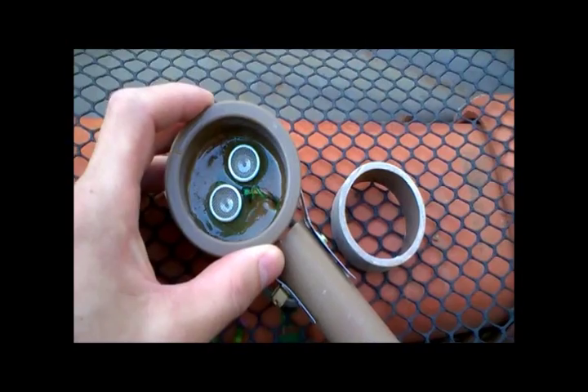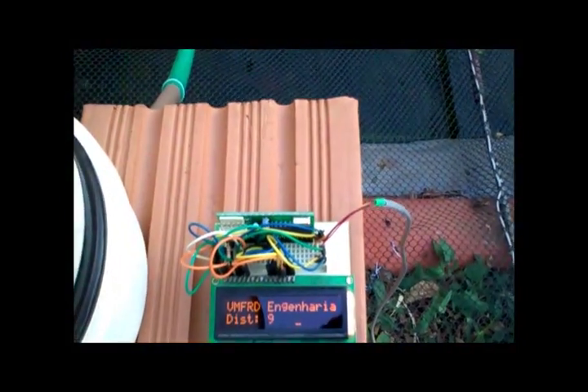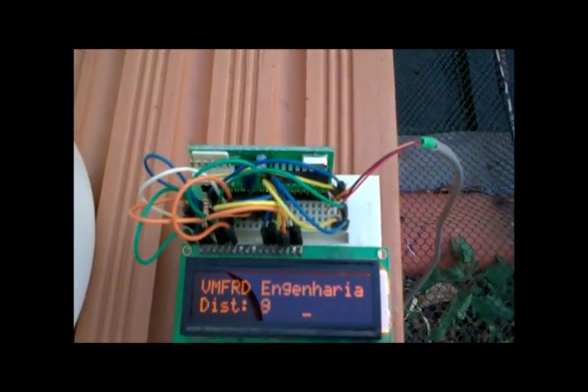So let's do some tests and see if I get good results. This is how the sensor is going to stay — underneath the bird net. I was first trying to take measures through the net, but I was getting some unstable readings. Sometimes the sensor was measuring the distance between itself and the bird net, and sometimes it was measuring the distance between itself and the water, which is what I want. So to fix that problem, I placed it underneath the bird net, and now the readings are quite good and quite stable.